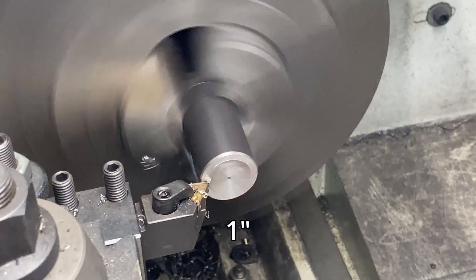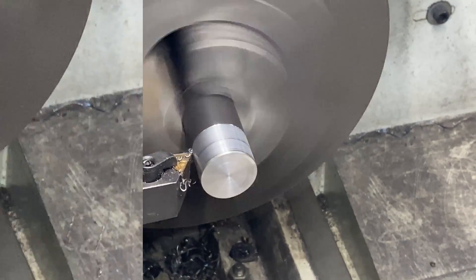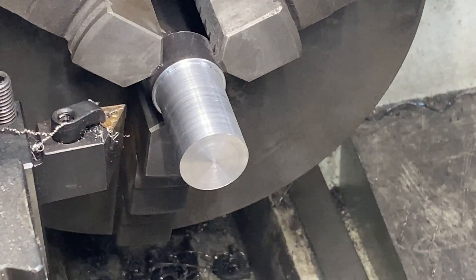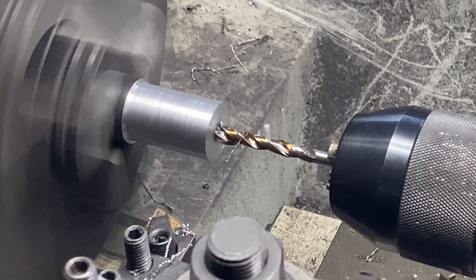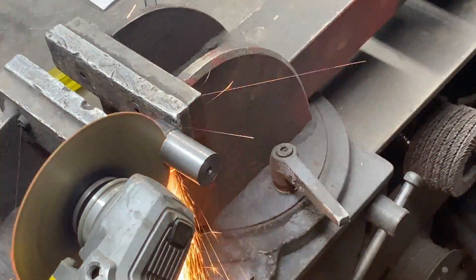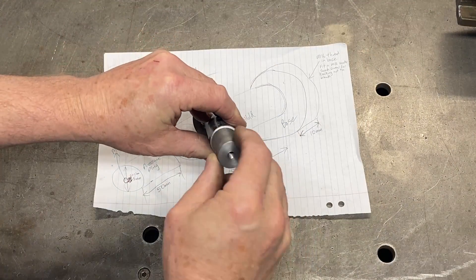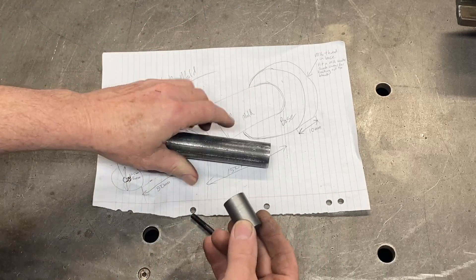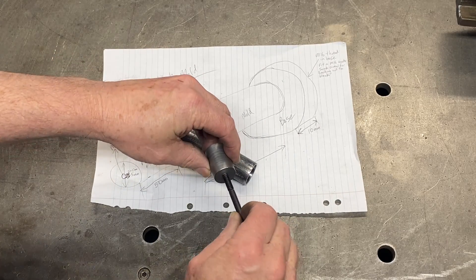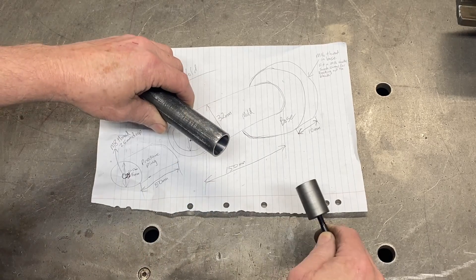Now I'm going to work on the plug. This is a short piece of 25 millimeter round bar. I tidy up the face and then start turning it down to 22 millimeters. The main body fits on nicely. Now I'm drilling out and tapping for an M6 bolt. The part held on the lathe is cut off and I tidy up the face off camera. So that's pretty much the mold complete — the plug slides in there easily. The diameter of the plug is 22 millimeters and the hole is 22.5, so there's a quarter of a millimeter clearance all the way around. That screw hole allows me to put a bolt in to pull the plug out if the plastic jams it.